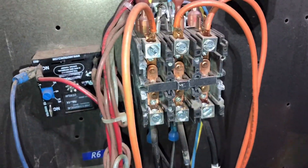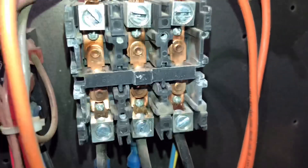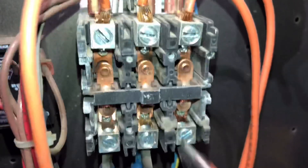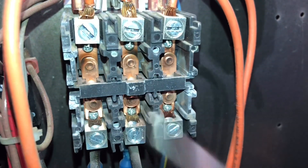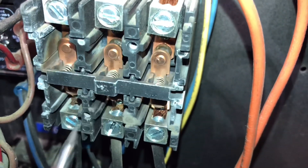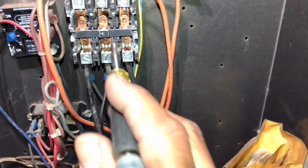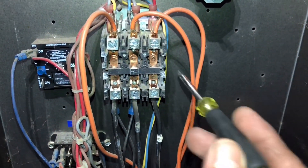Let me get a better angle. See — it gets stuck. Look, it's not getting stuck there — there it is, it got stuck right there. That's engaged, that's open. See, it got stuck again. So I'm gonna replace this contactor first before I do anything else. I wonder if this is playing with me — maybe it's giving me just enough voltage for my meter to read, but not enough actual voltage to pull any amps. So I'm gonna replace this.